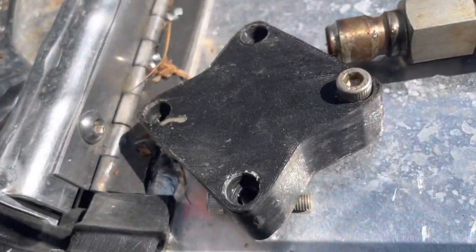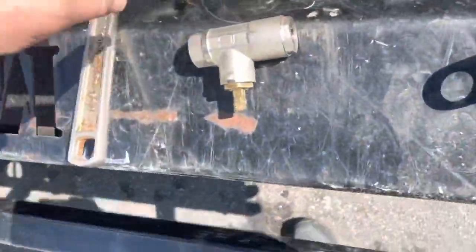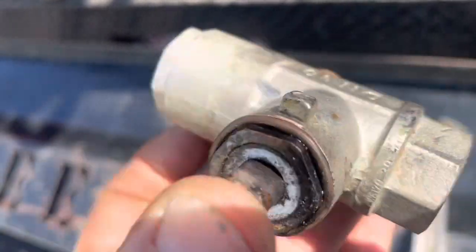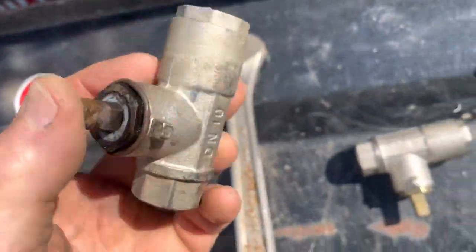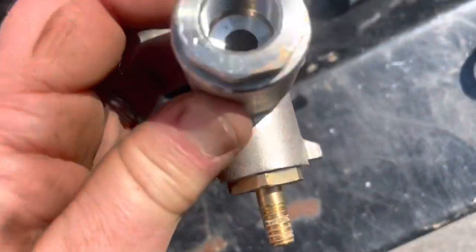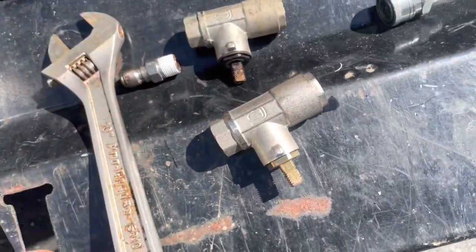So we take the flow pro apart - very easy. That plate comes off the bottom, the DN10 valve comes out. I've got everything quick-released in there. This is the valve that I took out. You can see it's fairly crusty inside. It seems to be opening and closing, but it's possible it's just too worn out and it's not making a good seal.